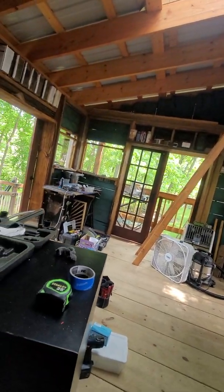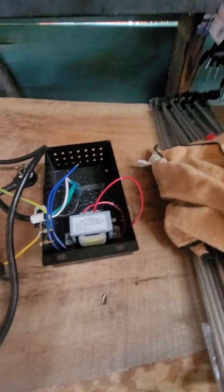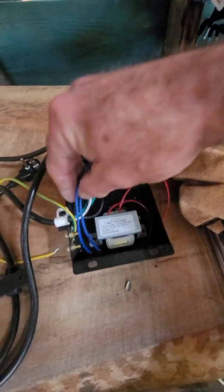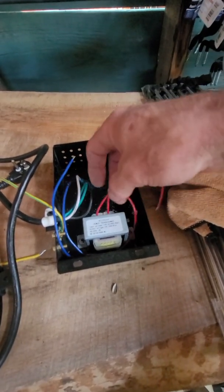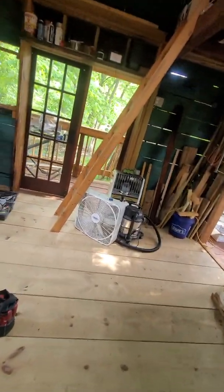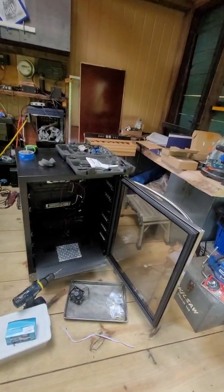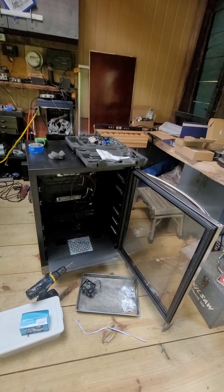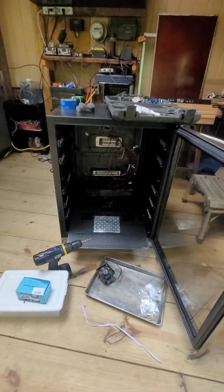This is the main power box that screws to the bottom. I put in a 12-volt transformer — you just connect the primaries to the main electric and it outputs 12 volts. Anything I want to run at 12 volts constantly that doesn't need to be switched — like a light inside — I can run power straight from there instead of using a wall transformer on the cable.